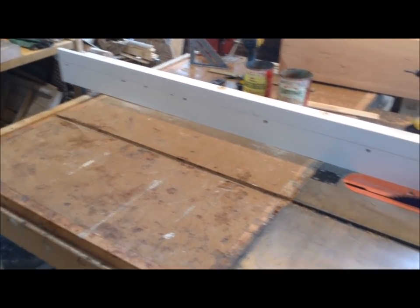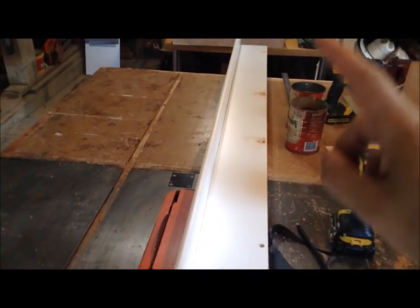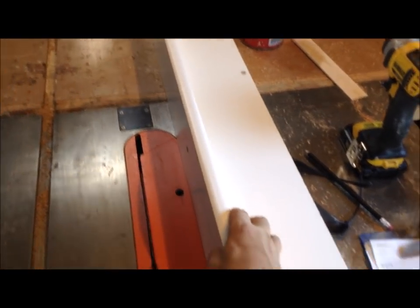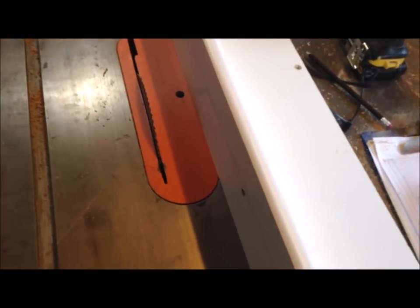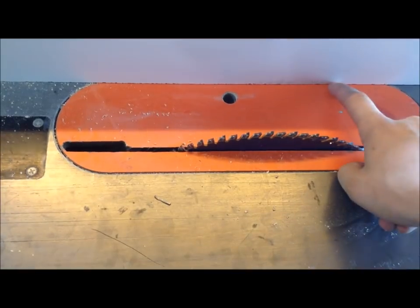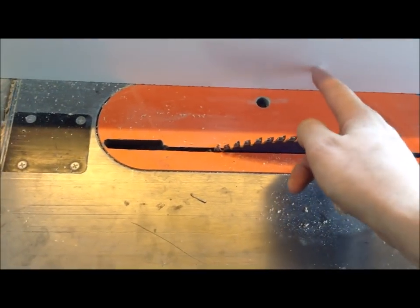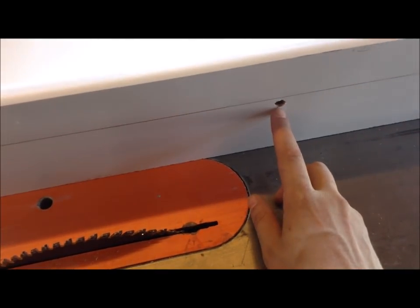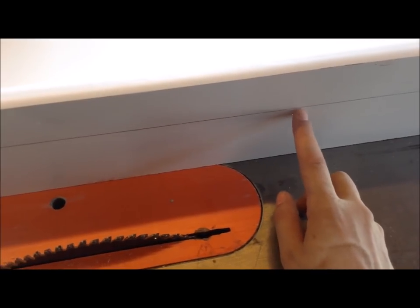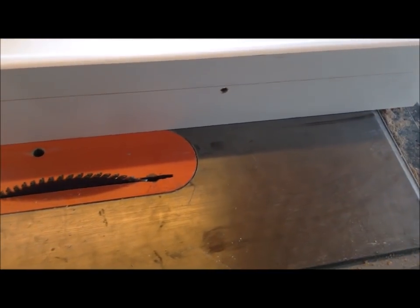Ideally you'd glue this, but one downside of having this laminate is you'd have to use an epoxy for it to stick to the plastic, so I'm just going to put a row of screws in here — countersunk so hardware never gets hit by your blade. Then another row of screws in the back side and everything will be connected. While you're screwing this together, I have two squares on my table — you want this face to be perfectly square to your table face. If it isn't square it defeats the purpose of this jig and you'll end up with weird lumber coming out the other end. I put a handful of countersunk inch-and-five-eighths screws into the front and then did the same to the back. Because of the plastic coating it slides nicely on top of my fence. I'm going to line up this edge right with the edge of my blade, lower the blade and slowly raise it, then slide this whole thing through until I get that cut in there.